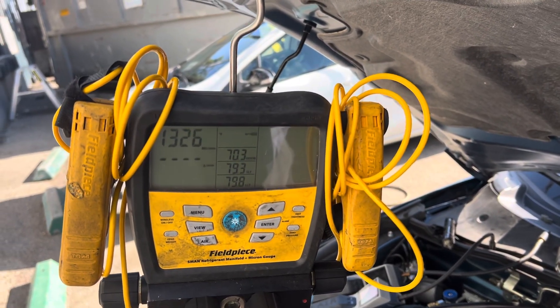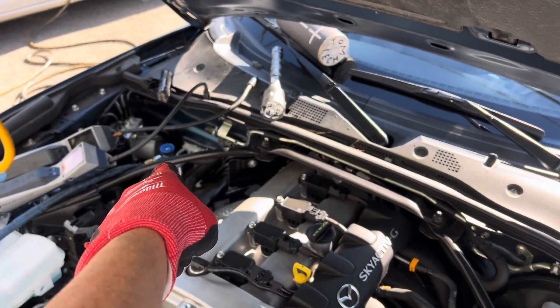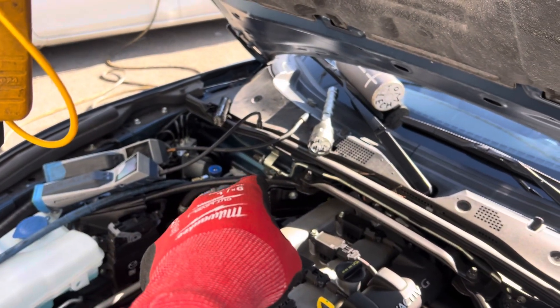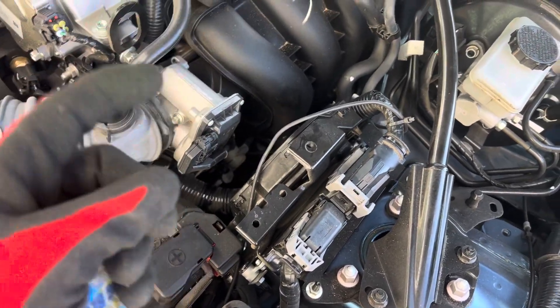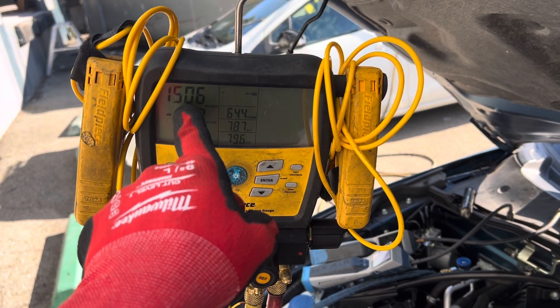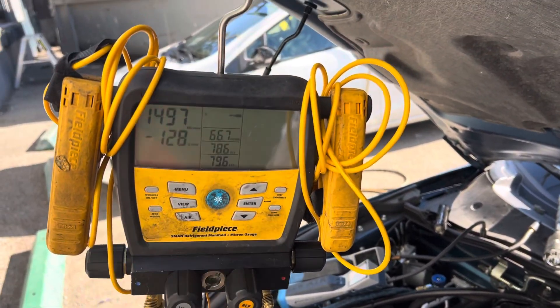Vacuum is off and you can see it's losing vacuum, but it almost looks like moisture content. I showed you with the UV light the leak over at the o-rings on the expansion valve, but those are so little that it doesn't leak under pressure — even at 200 psi. That's intermittent and only under certain operating conditions when it hits a certain temperature. Now check that out — did you see all the bubbles blasting out of that hose? From the last video it was bursting out bubbles all the way around — it has like a crack going almost all the way around, separating the hose from the compressor. But look at the vacuum on an analog gauge: that would pass on an analog gauge. An analog gauge can't even read this — the needle wouldn't even move. And look at it steadily now — I've got the vacuum off and it's steadily sitting as if it was holding.